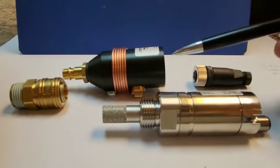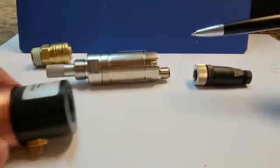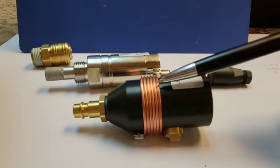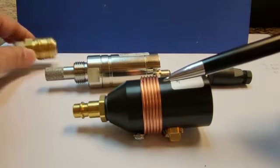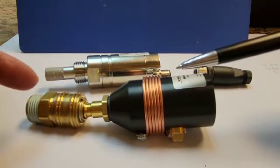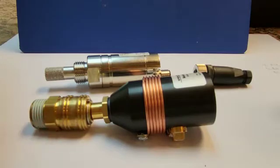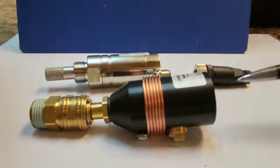The second component is this measuring chamber. You can see this measuring chamber is wound with copper tubing — inside there is a hole for the air to flow through. The purpose of this tubing is that when you install the sensor into the pipeline, in order to sense the humidity you need to have a sample. You go through this quick connector — this is called a quick connector — and the air pressure comes in and totally fills this chamber. The sensor is inserted into here.